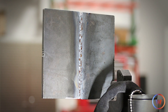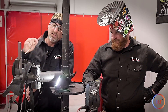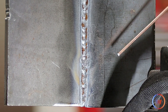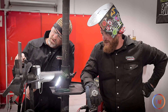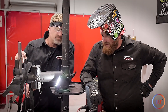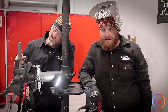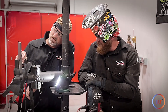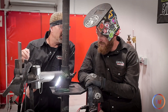So to tell the tale: I did the first two inches, Bob did the last five inches. As you can see, we should have started a little lower on that tack, heated it up, and then just twisted the wire and pushed a little wire to it. It made the tie-in a little flat — not exactly what we wanted. It may not pass — that's under flush. In the real world I'd have to grind that out on the other side and add more material.